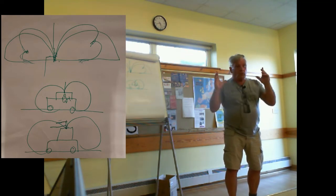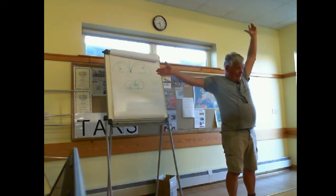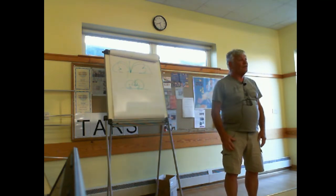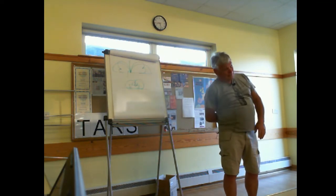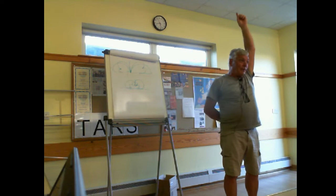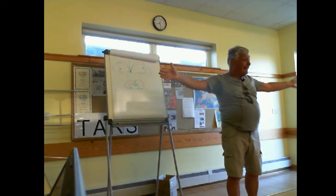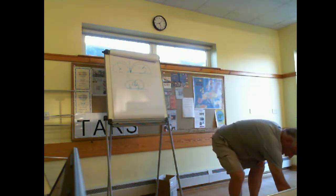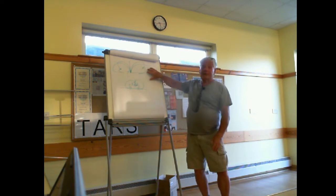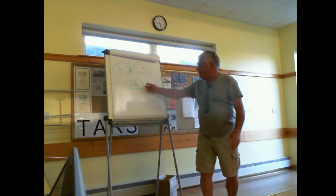Now the other thing is that, as you all know, radio waves are made up of 2 components. The electrical component and the magnetic component. Now, the thing is that the electric component cannot propagate across a horizontal surface. So this bit don't go nowhere. And this bit, the electrical bit, actually can't transmit up a monopole. It can only transmit out from a monopole. So there's nothing going up there, and there's everything going out here. So you take your balloon and then you push it down the middle like that. And that's the bit going down there. And of course, as you push it down, more of this pushes out. Right? Which is, you get what we've got there. The problem now is, if you go and remove some of that ground plane, it just sort of goes over the edge, like this.